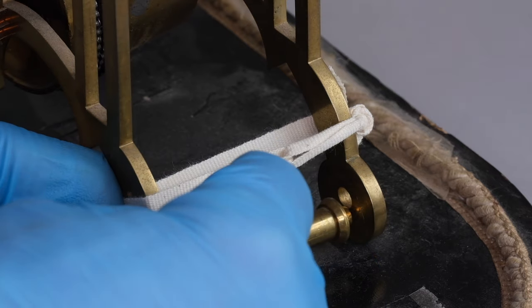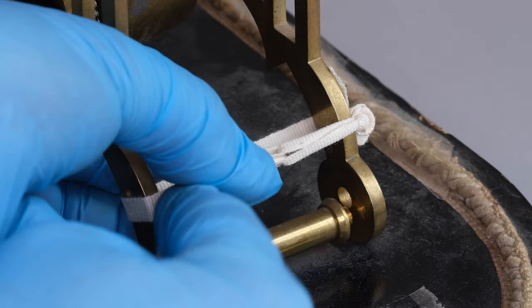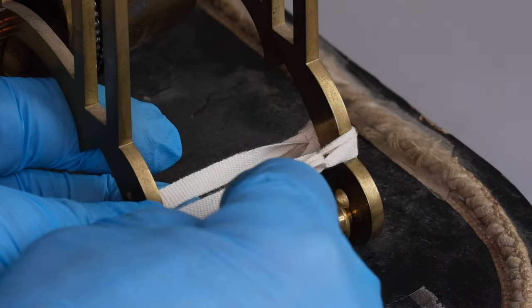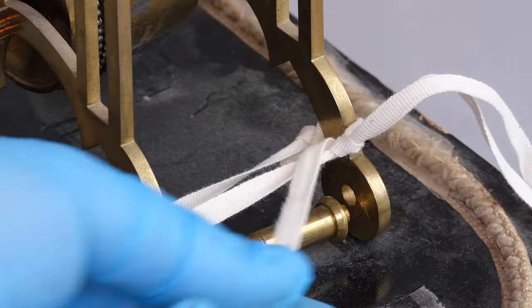So our first thing to do is to get the remaining power off that mainspring, just in case it causes more trouble. There's a risk of more damage to the mechanism and a smaller risk of personal injury as well. So to that end, I tied the frame with archival cotton tape, and wearing safety gloves and eye protection, I let the power off the mainspring using a mainspring letdown tool via the fusee setup ratchet.